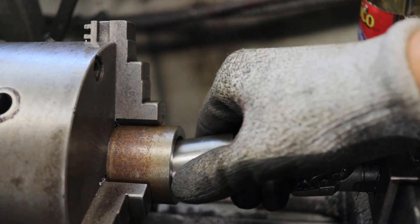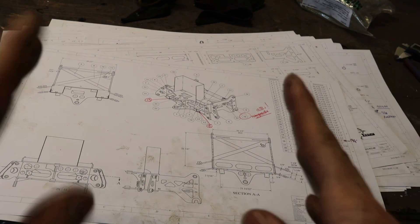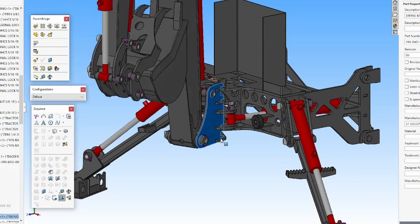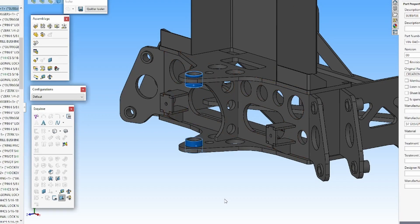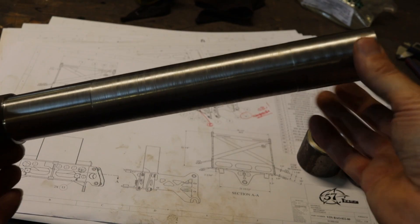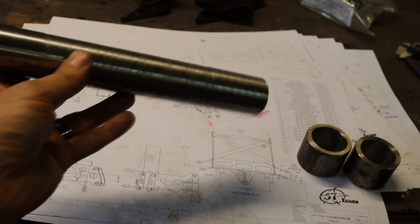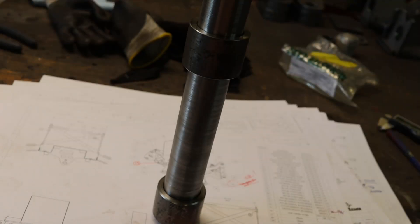There's no chance it's gonna get in — there's two thou of interference. Alright, so this is the base of the backhoe. There's a crucial part that I need to fabricate which needs to be perfectly aligned. Let me show you with a 3D. This is the main pivot — the main swing of the boom — and it is made of two main sections: the top and the bottom one. These two sections need to be perfectly aligned. To do so, I machined myself what I'll call a dog bone, since the two sections are a bit thicker than the middle one. This dog bone will help me align the two drill bushing housings. I'll put one here and the other one at the bottom, use this to align the two housings, and then weld everything rock solid.